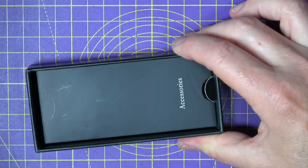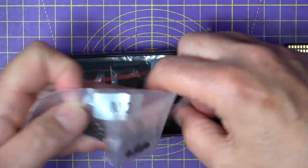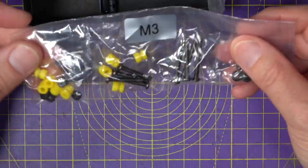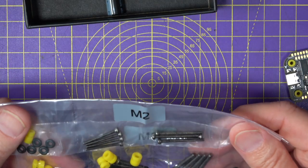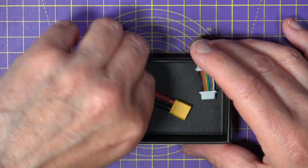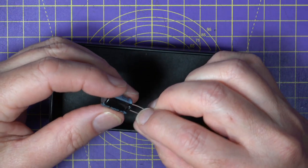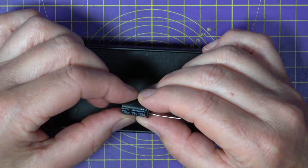Looking at the accessories in the box: you get the mounting hardware, and you get two sets. This was something they first started doing on their F7 Mini — you get an M2 mounting kit and an M3 mounting kit to suit whichever frame you're fitting this in, along with all the different matching sets of gummies to cope with the different sizes. You also get an XT30 power connector — that's the interconnect to go between the flight controller and the ESC — and the low ESR noise suppression capacitor, which appears to be 470 microfarads at 35 volts, making it suitable for anything up to 6S.